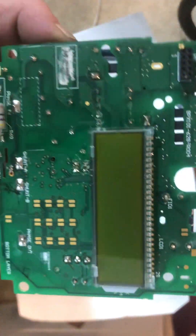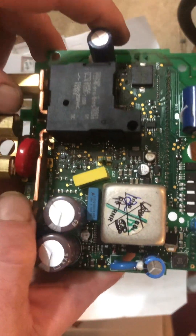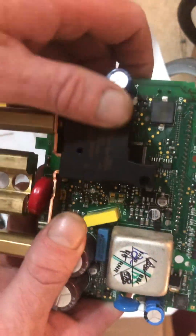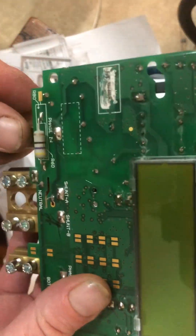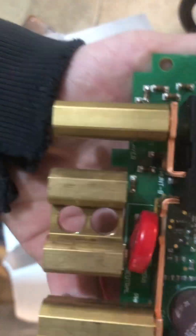It's very well made. Pretty standard — there's an SPD, basically a shunt in there, a couple of smoothing capacitors, your power supply, and a big chunky switch. What did get me curious though: there's your live, but your neutral bar is not monitored at all.